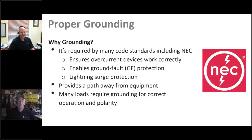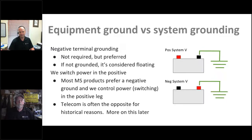System grounding provides a proper zero-volt reference so that electronics behave correctly and everything operates as designed. For example, a new smart fan switch with Wi-Fi control needed both a neutral and a ground connection because it has three- or five-volt electronics inside that require a true ground — something the old switch from decades ago did not need.